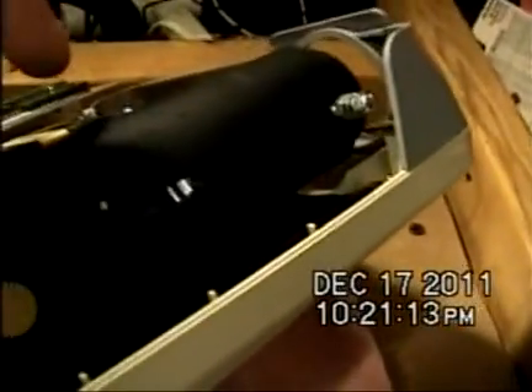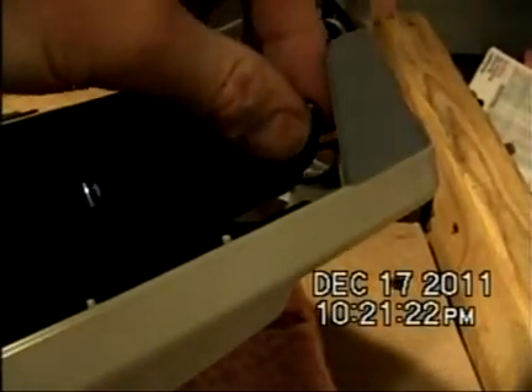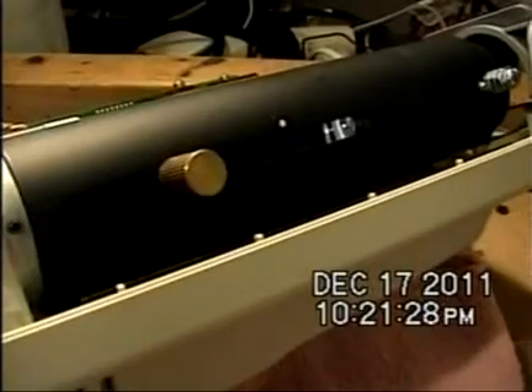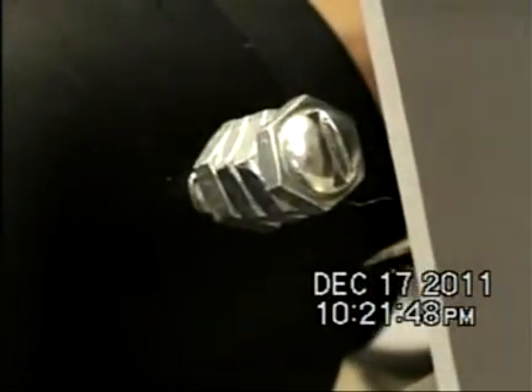It works. It's definitely not original equipment, but the way it was before, it didn't work. Under this situation, at least it can be recalibrated by loosening this and moving the tube in or out, as well as focusing or adjusting with this one as well. It's not real pretty, but it's back to full functioning. I was able to drill through the center of the screw, but when I used the easy-out extractor it just kept chewing up the metal. This is a 6-32 size screw — maybe I can find a nice looking knob for it, but this will work.